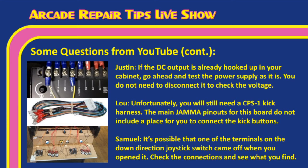And then Samuel, it's possible that one of the terminals on the down direction joystick switch came off when you opened it. It could have been either the ground terminal or it could have been the activation terminal for down. Check the connections and see what you find when you open it back up. Tim, it is super common, you know this, that when you open up a control panel, one of the terminals comes undone or a wire comes out of the terminal or whatever the case may be. Because when you reach up in there with your hand to unlatch it, a lot of times you will catch some wires, or when you physically open and close it, some of those wires will catch.